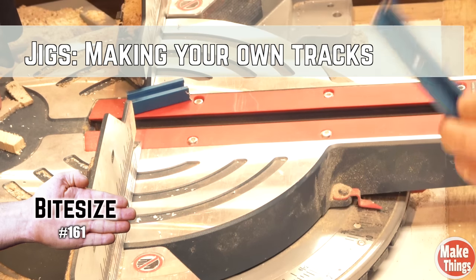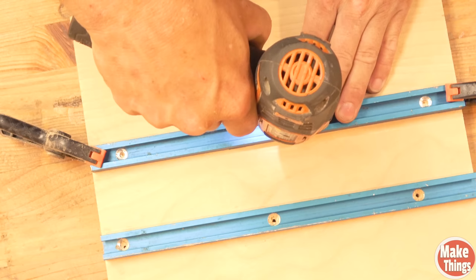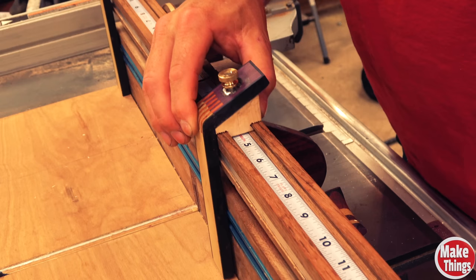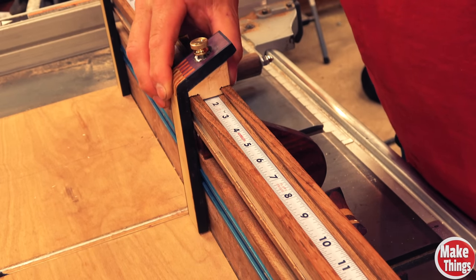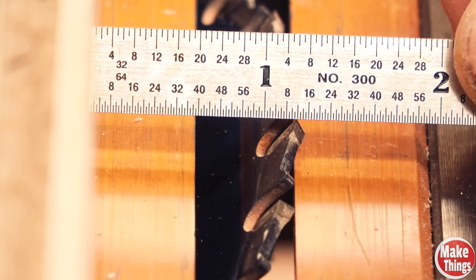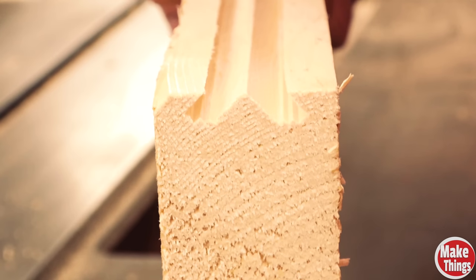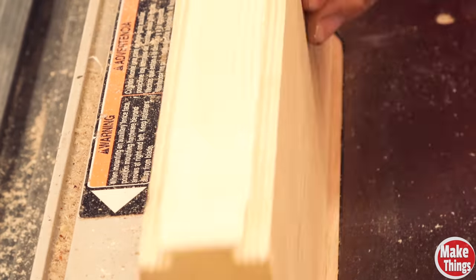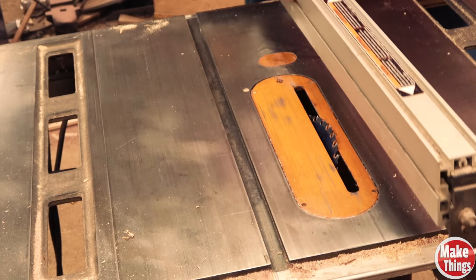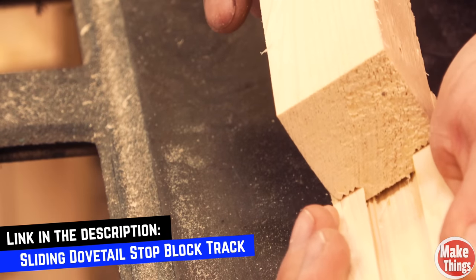By and far my favorite go-to for adding channel jigs is aluminum T-tracks. They're strong, durable, and easy to add. But there are times when making my own tracks has been a better solution. When I made my sliding dovetail track for my table saw sled, I opted to create a dovetail sliding arm as it limited movement. To create it, I used my blade set at a 45-degree angle, chose a piece of solid wood, and cut in from both sides. The arm that went into the channel was created by switching the fence to the opposite side of the blade and cutting again. For the full build, I've got a link in the description below.